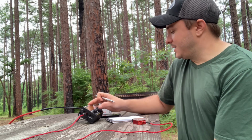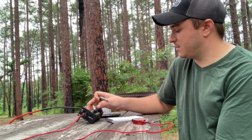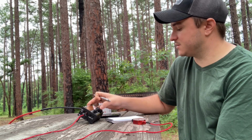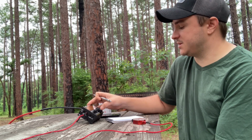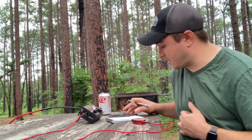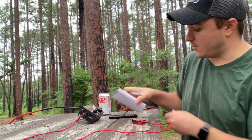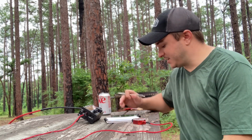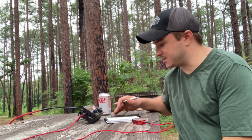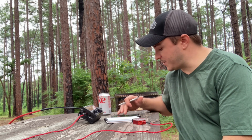So, all right, I'm going to come up here. I'm actually going to go around the QRP frequency, 14.0, I'm going to come up to about 6.1 or so, if there's a free spot up there. 14.060 is the QRP calling frequency, and if you tune your radio to that, there's almost always somebody on 14.060, it seems, but I have pretty good results right around that range. So if you go 60 to 62, 63, it seems like people are searching for folks in that area.